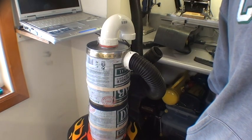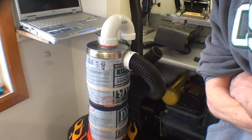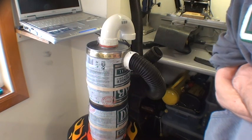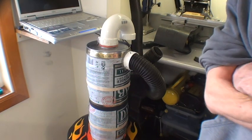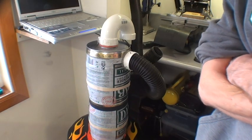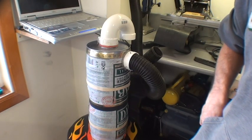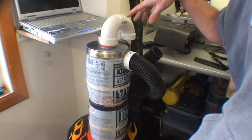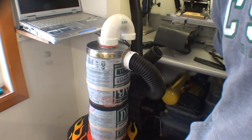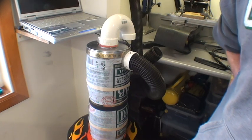I know Dyson advertises that it took 12 years to make a perfect one, but you can make one that will capture a good 90% of the solid materials in just a few hours. As long as you're spinning the air around in a tornado vortex shape, it will probably work. I've seen a lot of different designs — it's a quick and easy thing to make your shop vac work better.